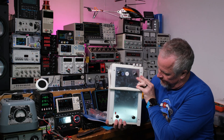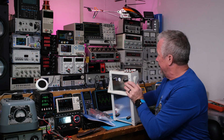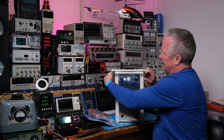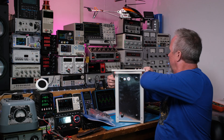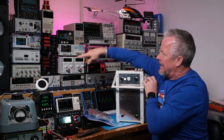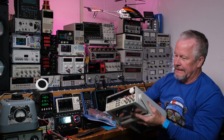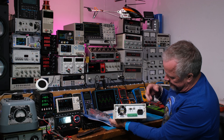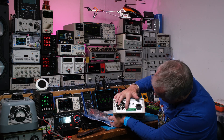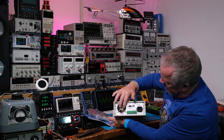It has some large feet here. And here's a switch for 110/220. Now, this kind of form factor of power supply — or multimeter, LCR meter — this looks like the same form factor as the LCR meter, but they have these handles that you pull out. This thing has been around — I want to say at least as long as I've been in electronics. Hewlett Packard had a lot of these, Rohde & Schwarz has handles like this. So this kind of form factor has been around for a long time — it's kind of a standard. AC with the fuse, RS-232 USB, and this jumper block already has a bunch of jumpers on it — channel 1, channel 2, and channel 3. And of course we have our fan.